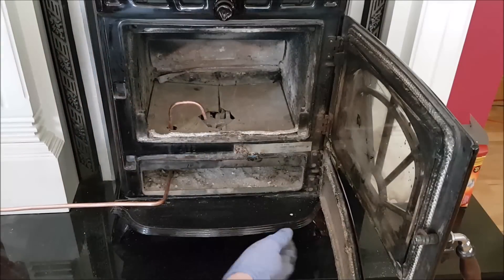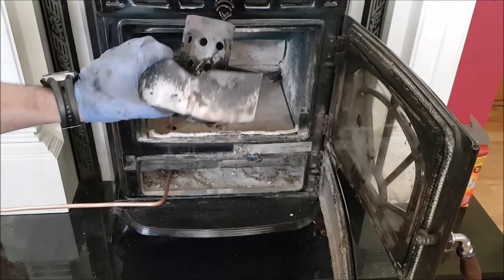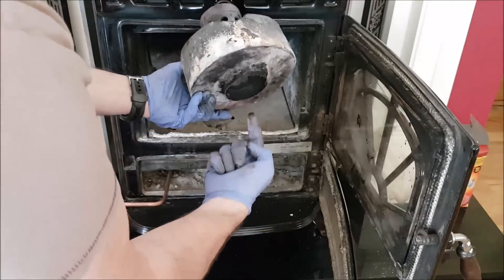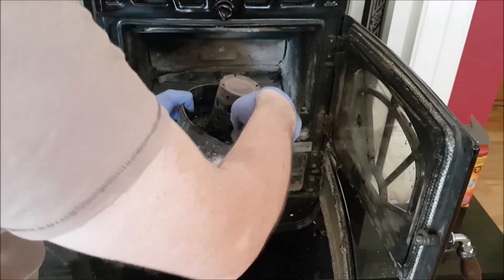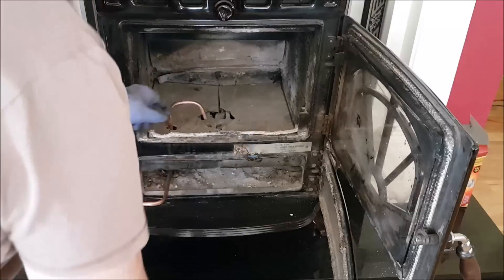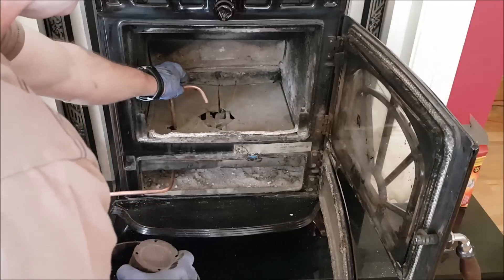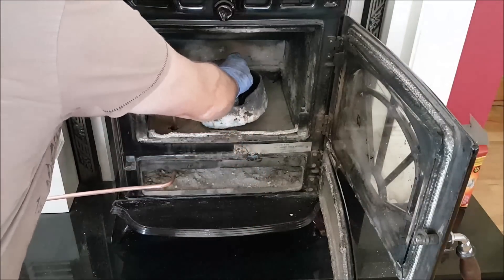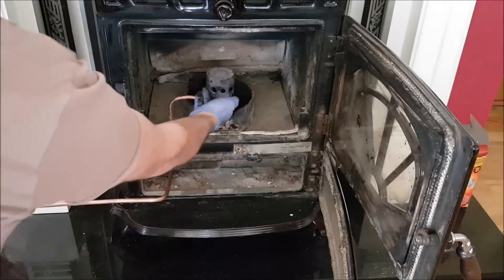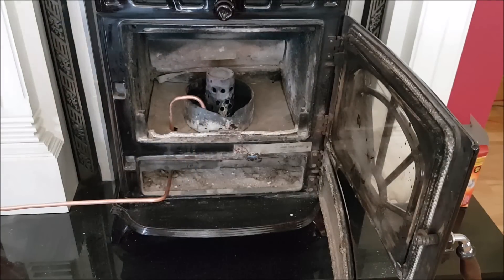I've blocked off the bottom entry of the stove, so air comes in through here and goes up through my burner unit. You can see that in other videos if this is the first time you're here. Essentially air comes in through the bottom, gets blown out through these holes, and the combustion happens here. Beyond this is my oil feed, so I'm dripping oil into this bowl area where it burns. The plates on the bottom force the air to come up in this area only.